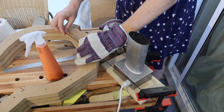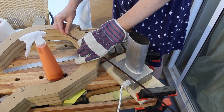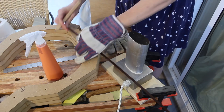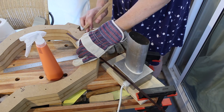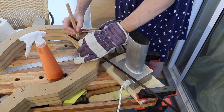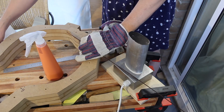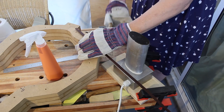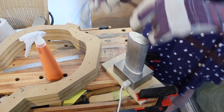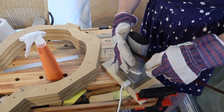This is where I'm going to start — this is the bottom of the guitar. The key thing is that this is the center of a curve, and this is the break point where the curve goes the other way. So I want to bend just that part. You can see why I've chosen to have extra at the end — you just can't bend right up to the middle of the curve. I'm just going to mark on here — that's the other extreme of the curve — and put a gentle curve on there to begin with. I'm going to try and work either side of that mark.